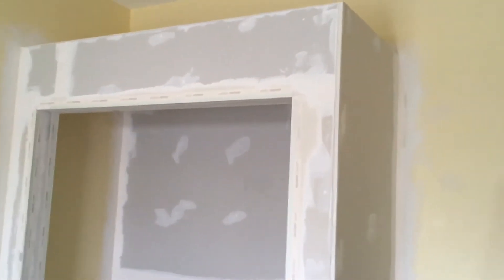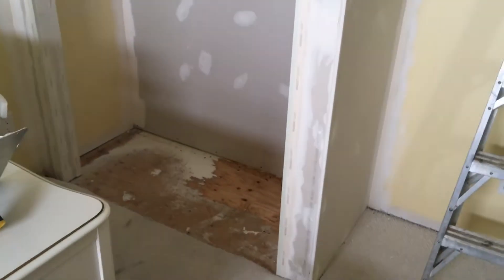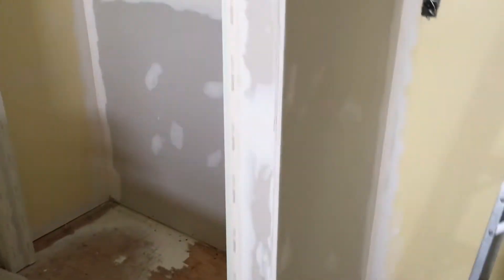Here's another update. Got most of the taping done right now. What I'm doing is putting up the edging in these spots where the closet doors are going to go. I've put square edging because this is going to be square. The next step will be to put a second layer of filler on top and then the finish coat.